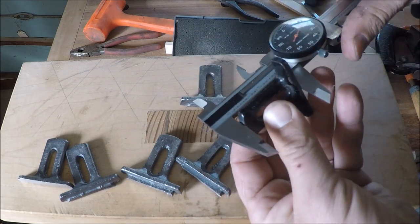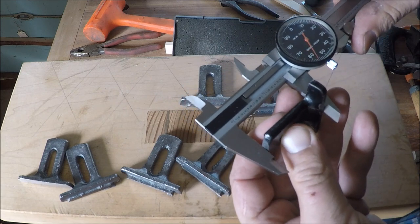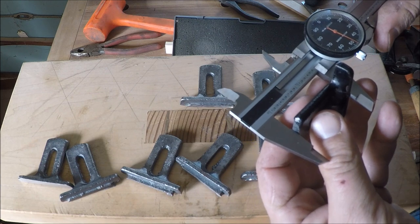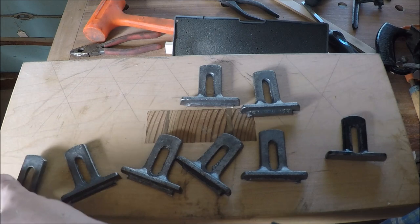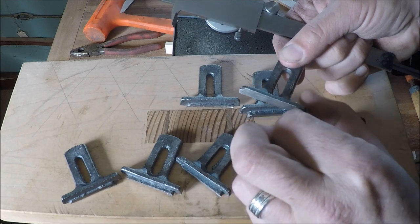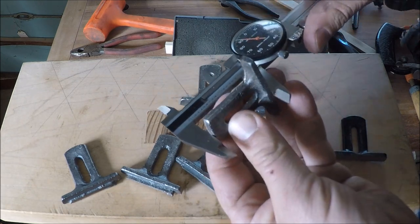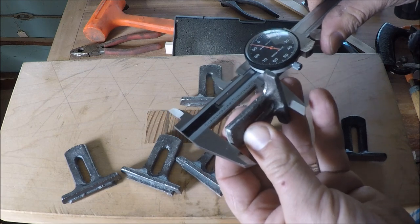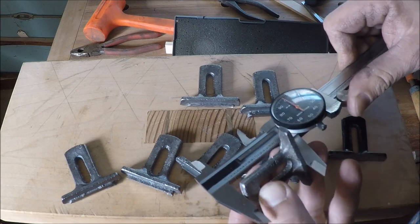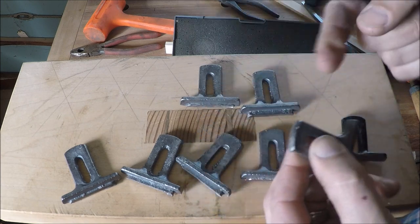So let's see how big this part here is — this is the original one. Overall, this is more or less about an inch 650, yeah, something like an inch 648 or so. So this one here, on the bottom of it, it's going to be just a little bit thin here because I had to grind the bottom of this. We're actually oversized. That's right on an inch 700 and one or two thousandths. There's a little bit of flashing up here.